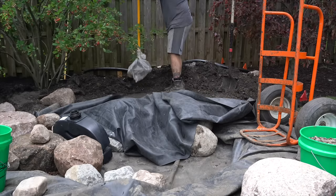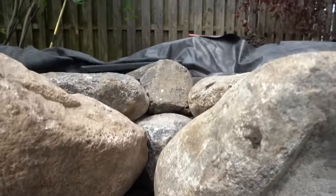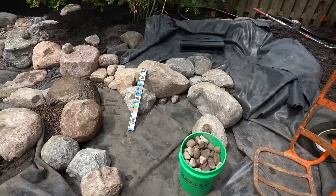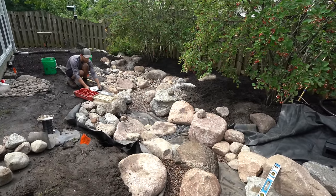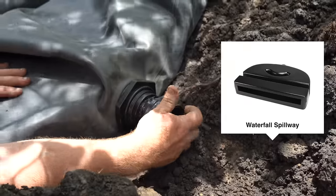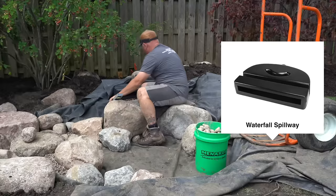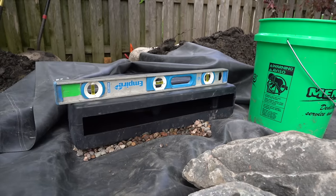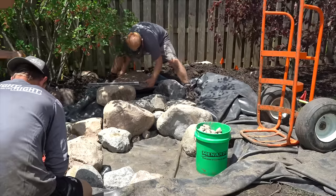Here I am compacting the soil behind it, making sure things won't settle. I've got my waterfall set at the height I want everything to start at — one of the key things with building a waterfall is setting it to the scale of the yard. This waterfall is set at a maximum of 14 to 15 inches. Putting the spillway in is a really easy process, then I backfill with soil over the top of it and level things off, making sure it's not going to rock left, right, or front to back.